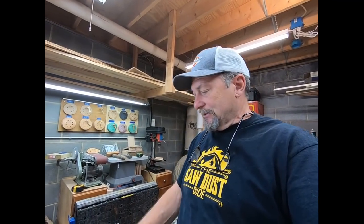All right, one of the things when you're using a router machine or a router table, gosh, that thing just spins at a gazillion miles an hour, and you want to keep those fingers out of the way. So on a stock that's about a 1/2 inch thick, I really want to keep my fingers out of the way, because if that thing would kick out or kick back or something like that, it would, yeah. I work with these. I want to protect them. So I use one of these. It's a push pad, but see how it's kind of beveled like that, and the bevel's towards you, so you're not straight up and down.